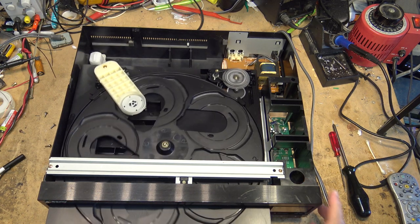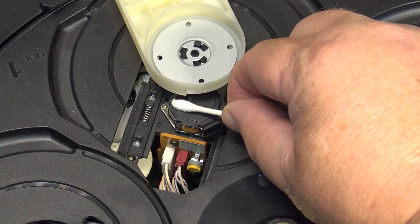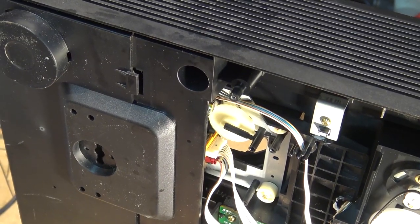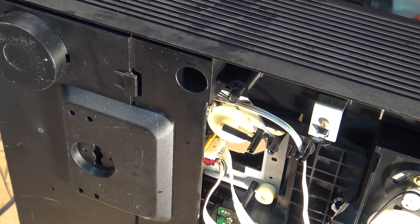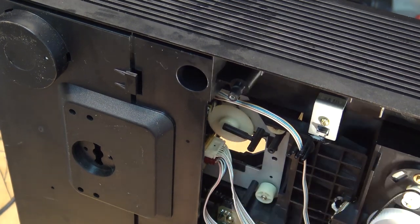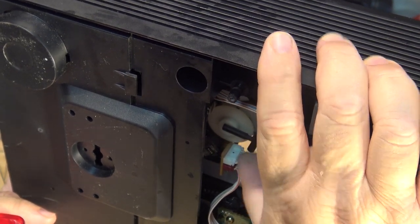As long as it plays, it might be worthwhile to just put a bit of grease on the gears there, just to make sure they're not going to be a problem. I will clean off the laser - just wipe that off, any dust that's on there. This one doesn't appear to have any old grease on it - it doesn't look like it was ever greased. So this one will be relatively easy to put some grease on. I'm going to put some grease onto the rail here and onto the gears and let it work its way in. We don't need to put a lot of grease in - too much grease is worse than not enough. If you have too much grease in there, it will actually attract dirt. So we don't want to put too much on there - just enough so that things won't stick.